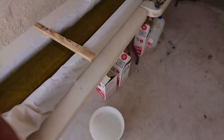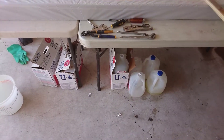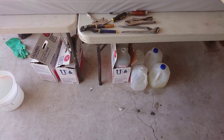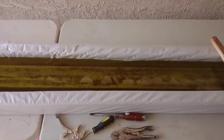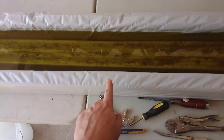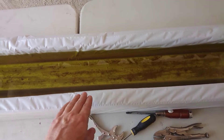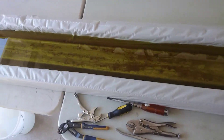What I've got over here is a muriatic acid bath. This is basically pool acid that you can get from the hardware store — about $10 a box for two gallons, so I've got six gallons here. I've got the metal sitting in the muriatic acid bath. I used two steel pieces to make kind of a well, and then I've got some bricks on both ends. This has been sitting for about 30 minutes.